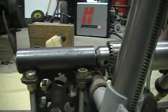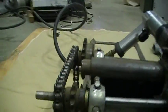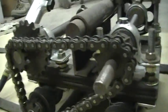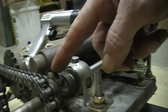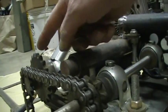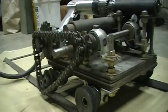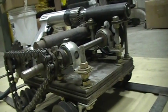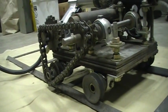That runs like a little worm gear. As you turn the drill on, the drill spins and turns the other gear, which in turn runs these little chains and sprockets on the other side. I initially set this up for double gear reduction using this smaller sprocket on the back side to run another chain, but after I got it all together I realized that the fine tooth sprocket was going to be plenty slow enough. So I never did put the other chain on and just run it like it is. This thing has really worked out great.